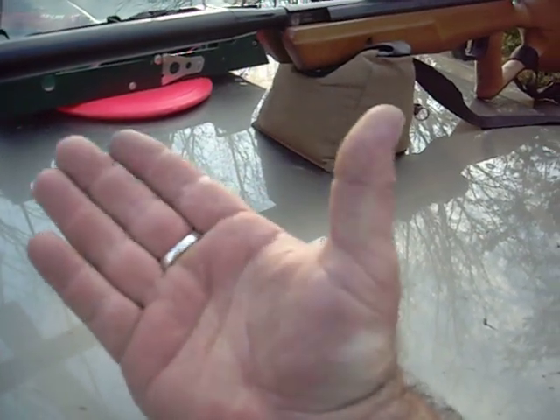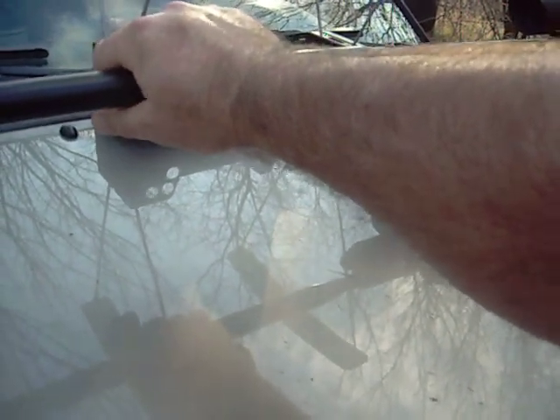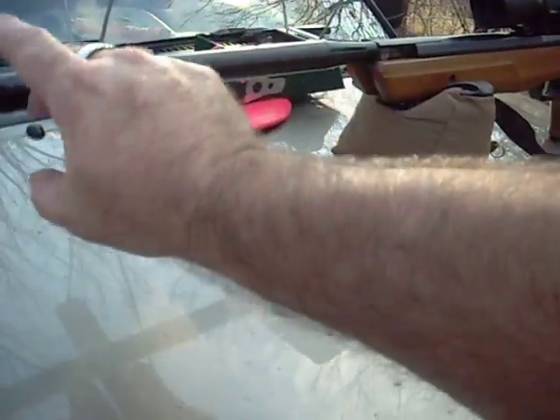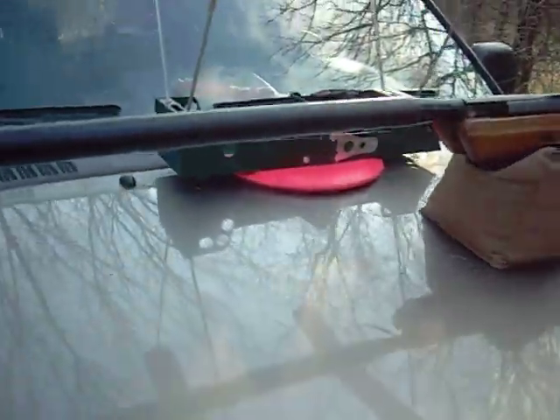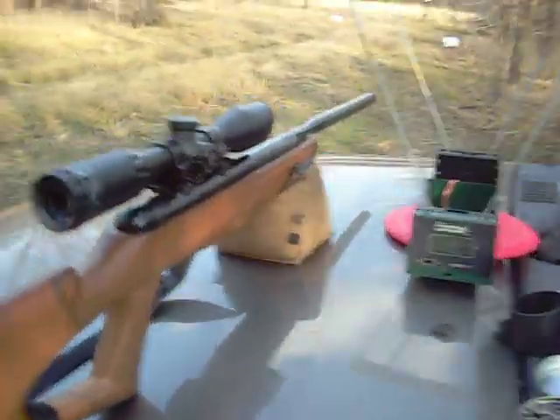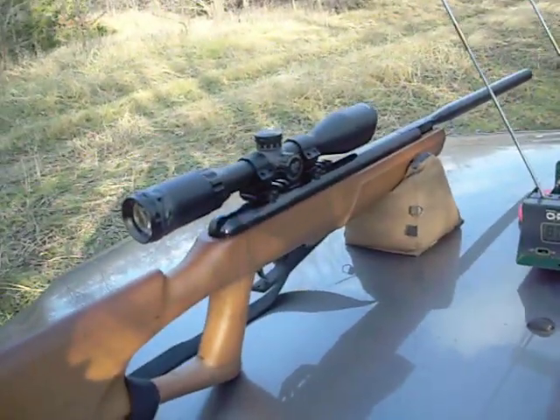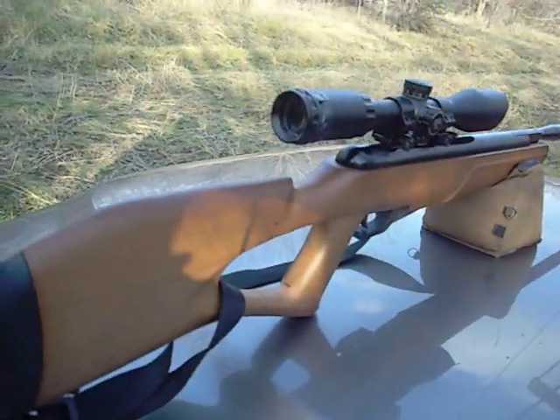I would experiment with, like, if I had just a piece of bendable lead sheet, I would take about three ounces and try to clamp it around here to see if that settles down the harmonics and makes it more accurate. It's just a little bit too light out here on the barrel, and I think that messes up the harmonics of the gun. Other than that, if you just did those things, it would be a $300 gun — you could price it at $300 and we'd still buy it.